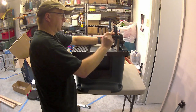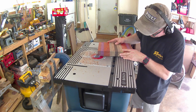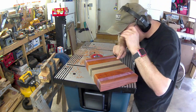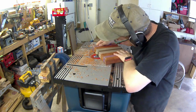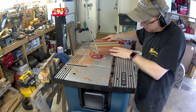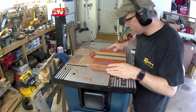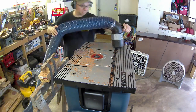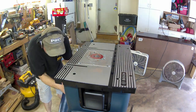I took it out to the garage and here I am doing my first rout. The fence is off and I had a little cover to stop dust from flying everywhere. I didn't have a hose attached — just had it hanging in the back trying to suck up as much as I could, which clearly wasn't doing much. One critical mistake was that the router speed was set too low, so I was getting some tearout I wasn't expecting. This router has adjustable speed and really needed to be at a much higher RPM. The final step was just cleaning up the dust.